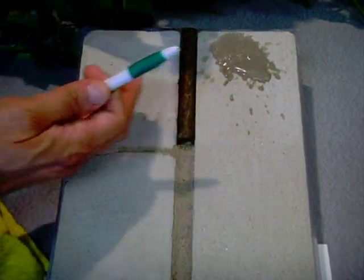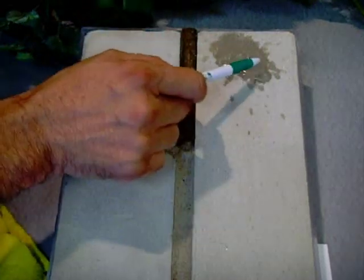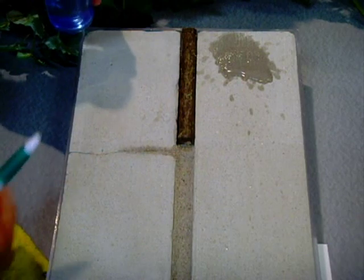On the unprotected side, the water is basically soaking into the concrete. When it freezes and gets cold, that water that has soaked in is going to freeze inside and damage the concrete. If the concrete has any weak areas, it will start spalling, pitting, and all those familiar things that happen with winter.